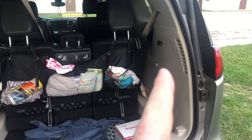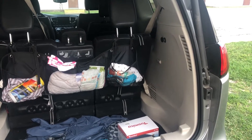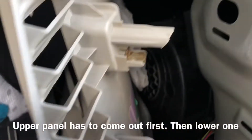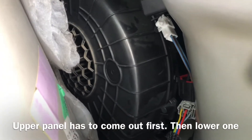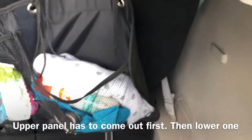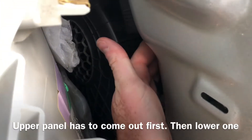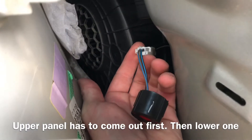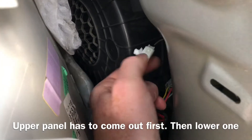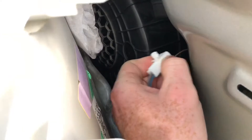You could have a bad chime. The beeper is on this side somewhere, so we're going to look over here on the passenger side of the vehicle and pull this back. You can see some stuff going on in there. That little white connector is what I'm looking for — it's normally attached to this wall right here. You have to reach around the corner and unattach it, which I've already done, and you can pull it out. This is your beeper, your speaker, whatever you call it. You push the little tab here in the middle and it should pop right loose.